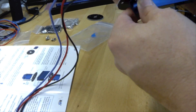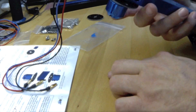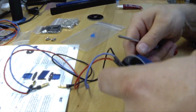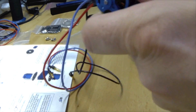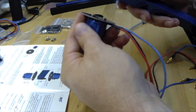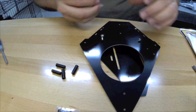Here you see me assembling the motors on the arms. One thing the manual says is to thread the cables from the top motors and bottom motors through the ends of the arms. I want you to take note of this picture right here — you'll see that big hole on the side of the arm. I did not use that hole, and I didn't look at the website until after I got my arms all assembled and the cables routed through the inside. But you may want to route at least one set of them through the side. This way, if you do have an accident and tip your quad over or land on an arm, you're not going to chop those wires off.